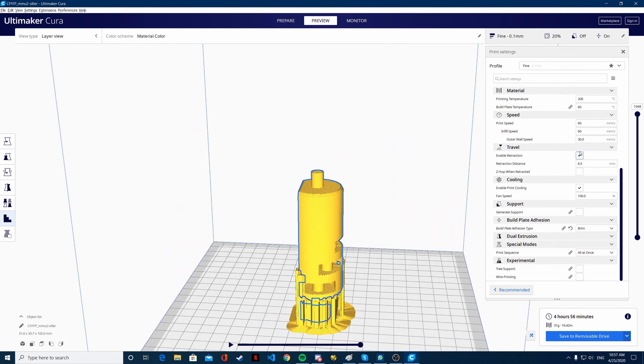Once this is done, you're going to need to pause the print head every time you are at the top of the bearing. You don't want to print the layer that covers it — you want it to be exactly there. In order to be precise enough, use your arrow up and down keys. Go up until you see it is starting to cover the bearing segment. Once you have found the first layer where it covers, go back down once and write down that number. Here we have 328. Now you repeat that with each bearing placement.